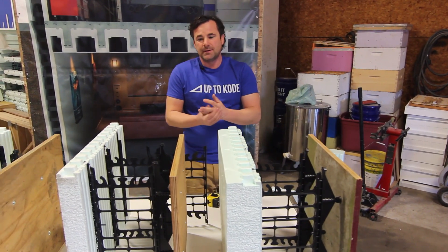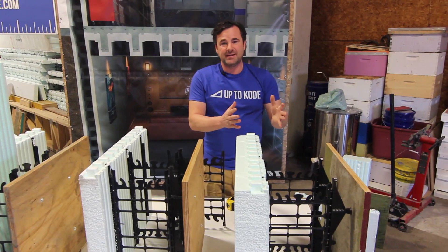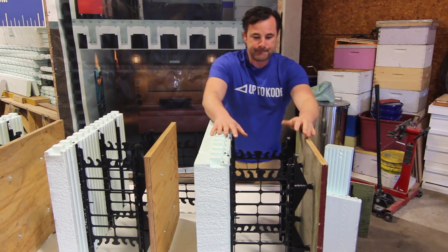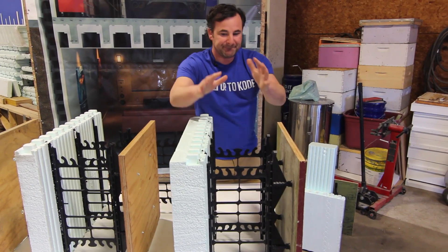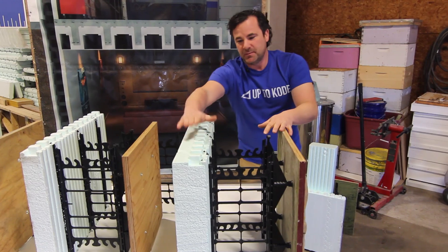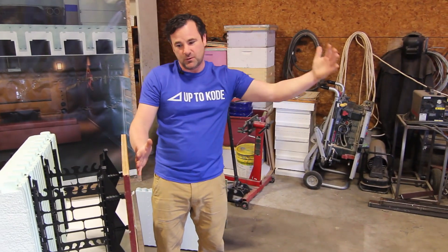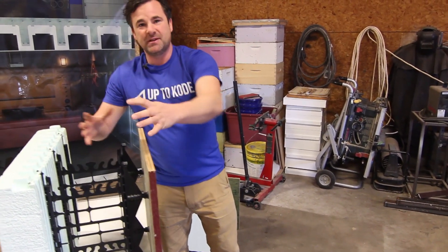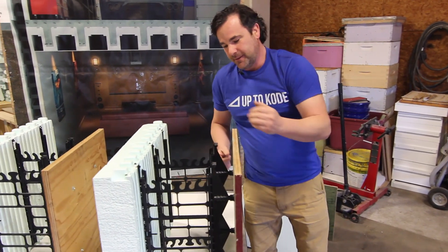Where you would use a system like this is in multiple different ways. I would love to see this in a passive house where this is the wall assembly — the concrete core is on the interior with a ton of insulation on the other side. Say the wall is running east to west, north side facing out, and your passive house utilizes south-facing windows. The south sun comes in wintertime and heats up the storage capacity — the thermal mass in this wall. That would be a beautiful application.